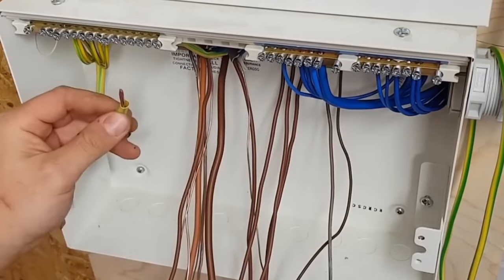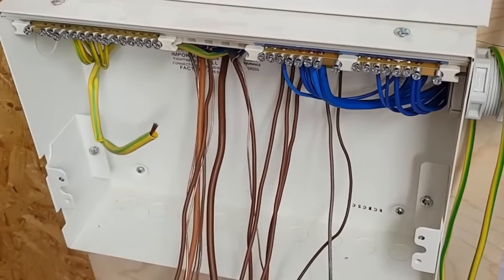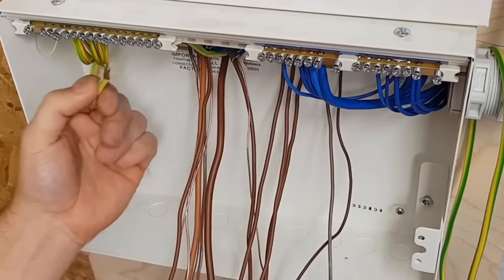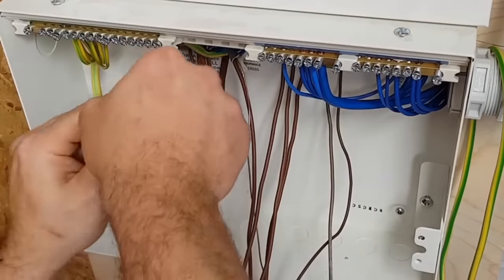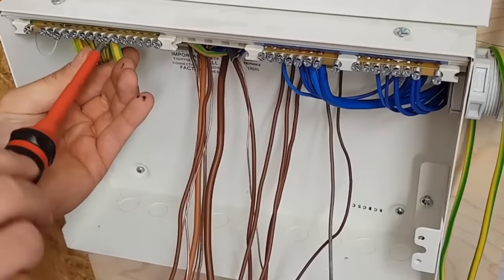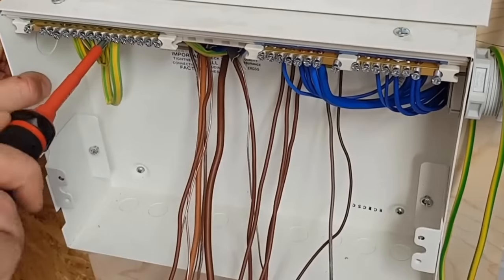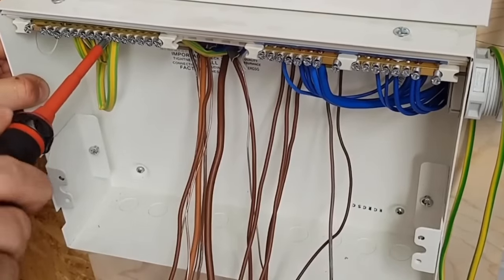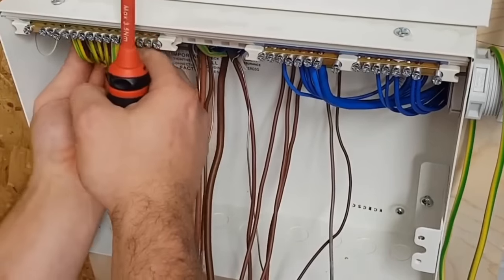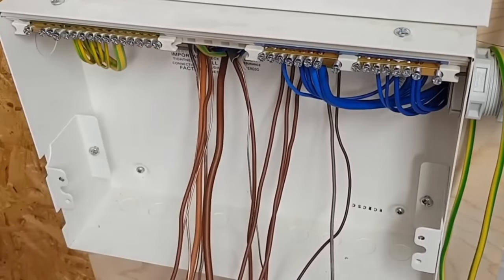Gary, would you attempt to bend that over? What is that, 4mm CPC? What we always say is gauge it against the size of the hole. If the hole is going to be better facilitated by a doubled over termination, then we'd double it over. But again, it's a judgment call. If you've gone singled in there, that would be fine as well. Holes nowadays, I find, in the time I've been out of industry, especially in ceiling roses and pendants, are a lot smaller for the loop, switch line and neutral than they ever were before.